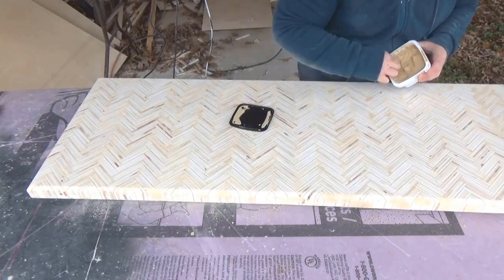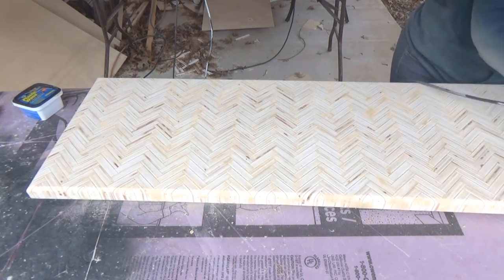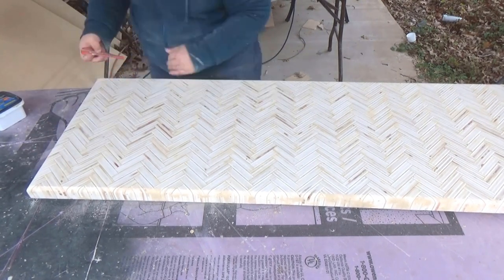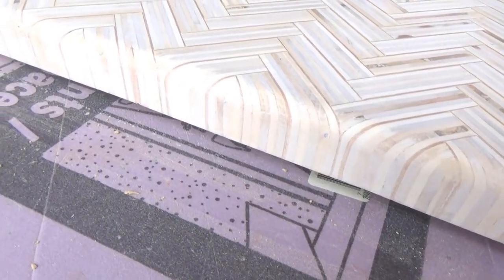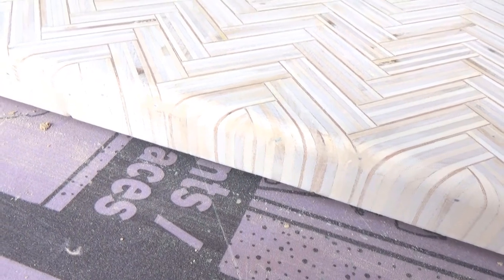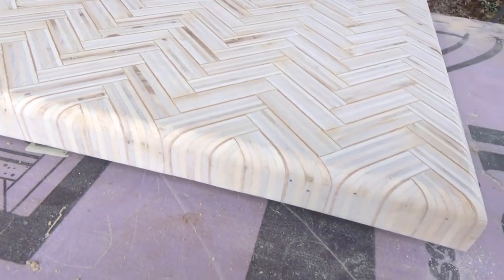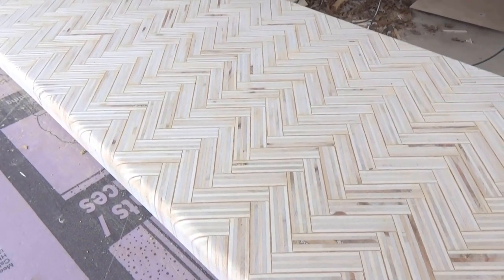The wood filler I used did work perfectly, though it took a long time to dry because of cold, rainy weather. Once I sanded off the wood filler, this tabletop looked beautiful — I was so excited. I sanded with my orbital sander starting at 150 grit, then worked up to 220, finishing by hand for a nice final finish. I love how the design spills over that rounded edge. I did have a couple of voids in the side I couldn't fill, but perfection is overrated — this tabletop is beautiful even with its imperfections.